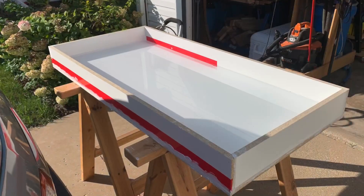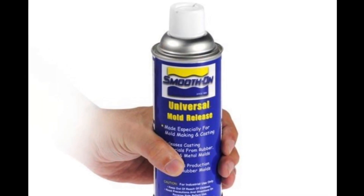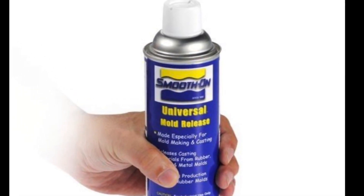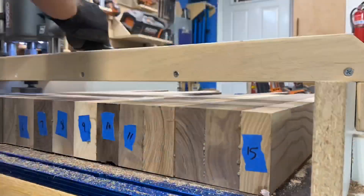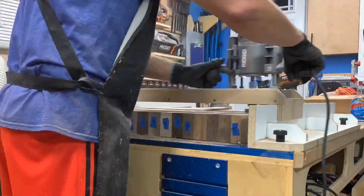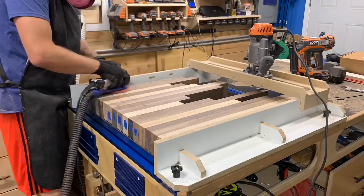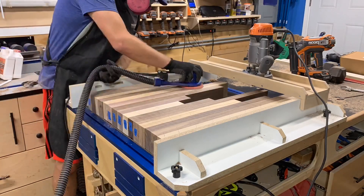I even water tested the mold for several hours — all good. I then sprayed the mold with mold release to help it from sticking to the epoxy. The next step was the messiest one. I wanted each wood segment to be perfectly flat, so I made a quick router sled rail set for my workbench. I was able to flatten each segment in about 10 minutes using the Whiteside 6220 router bit.